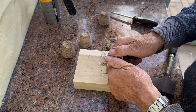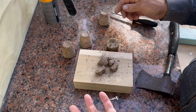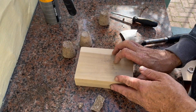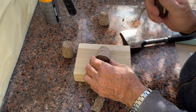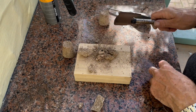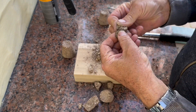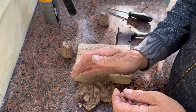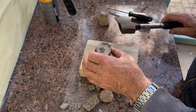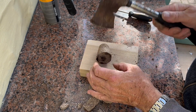Okay, so it took a fair bit of blowing and it's not easy to split in half - but that's number one, no fibres, not particularly successful or strong. Let's try the next one - this will be the one with the short basalt fibres in. It seems quite robust, but in actual fact that has fallen apart far easier than the one that didn't have any fibres in at all. They're very difficult to distribute those fibres evenly, but that was not a success. This is the one with the one inch basalt fibres in - I'm hoping this one's going to be a bit stronger. And it is - it took several clumps with the axe to break it in half, so that is definitely a better result.